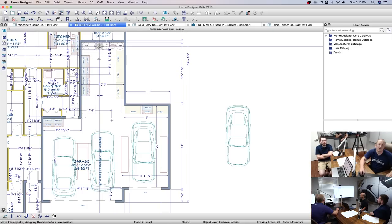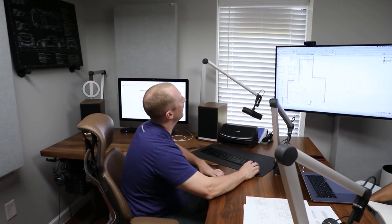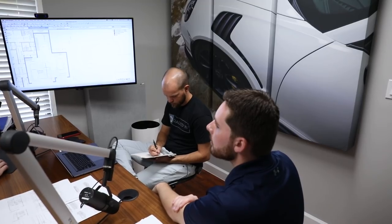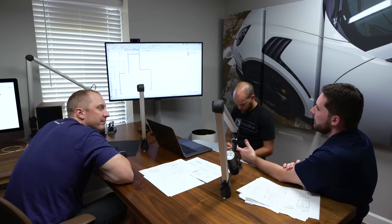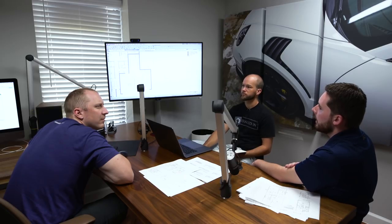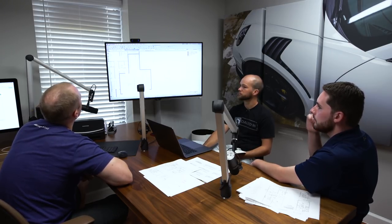We do your pressure washing system — the DI tanks right here, then the pressure washer above that — basically your whole pressure washing system in one spot. For the plumbing, you'd run off the water softener feeding the whole house. The outside loop for hose bibs and irrigation won't be part of the softener system since it's on its own water meter. But tying into the softener saves on DI costs in the long run. Your plumber just cuts in a tee and it goes right into your DI tank, which has a bypass built in.